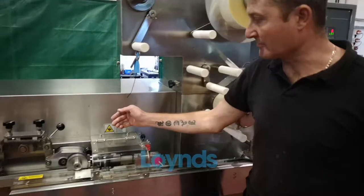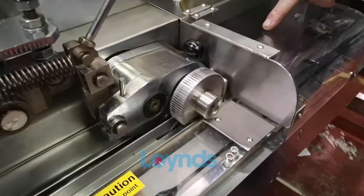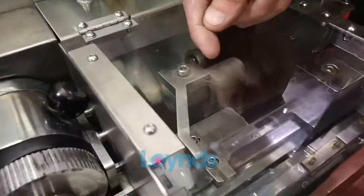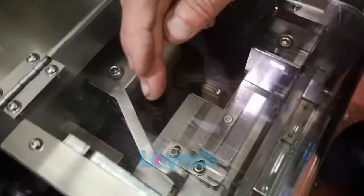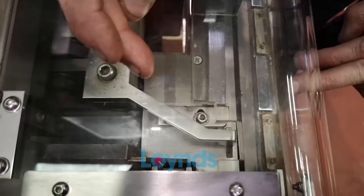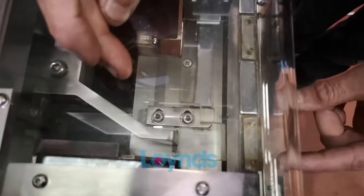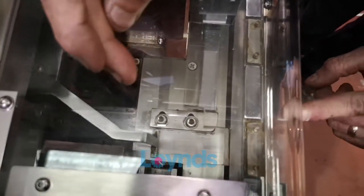The piece is driven along here and cut through the cutting blades, then pushed onto the chain with this pusher. It needs to be pushed so the first piece has passed but not too soon before the second one catches it — ideally just as it's past, it then pushes the product into the line.